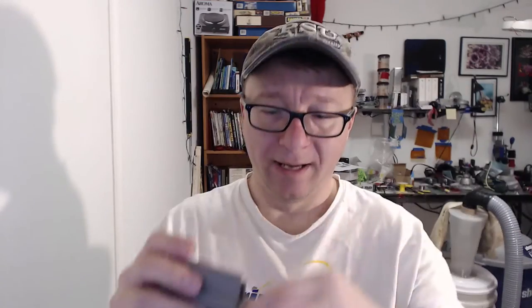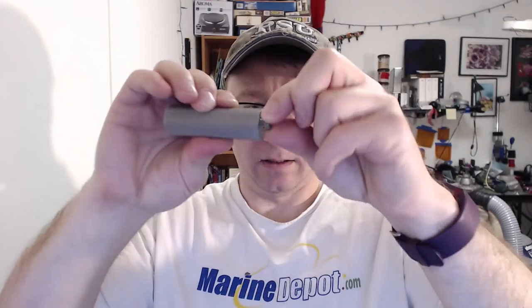What happened with this design is you can see these bolts here are really, really small. Let me pull it out and show you some of the details. It's very tiny and the threads are very teeny, and the minute I put them into the cradle they kind of just stripped out. It turns out there are two reasons: first, the threads are very small and at the resolution of 0.2 millimeters they didn't have a lot of area. Second, I printed it this way without supports in the hole, so there was stringing inside the hole and the threads didn't really form completely — there are no actual threads inside there.